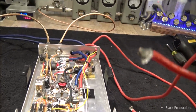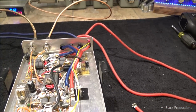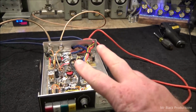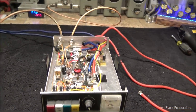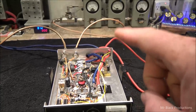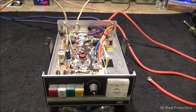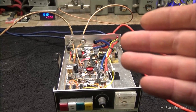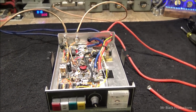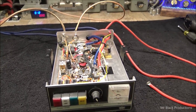If this wire is hooked up, now I learned this, I had a friend of mine, his name was Jim, and we had replaced the power leads on his 667, and the way we had it split was that there was 2 hots and 2 grounds. Well, he went and ran the thing, and as he's driving down the road in his semi, one of the hot legs came off. Bloop. And so then half the amplifier lost power. Guess what happened to the first 4 transistors that had power? Yep. The part that didn't have any power survived. The part that had power burned up because it didn't have any meters or anything.